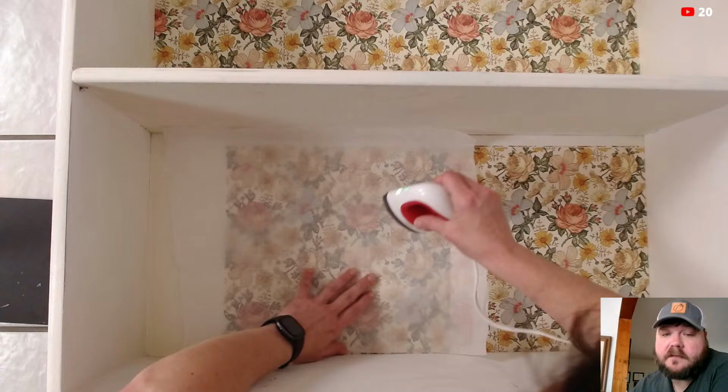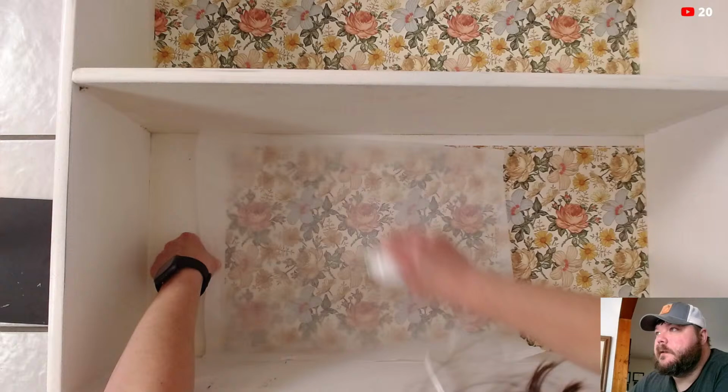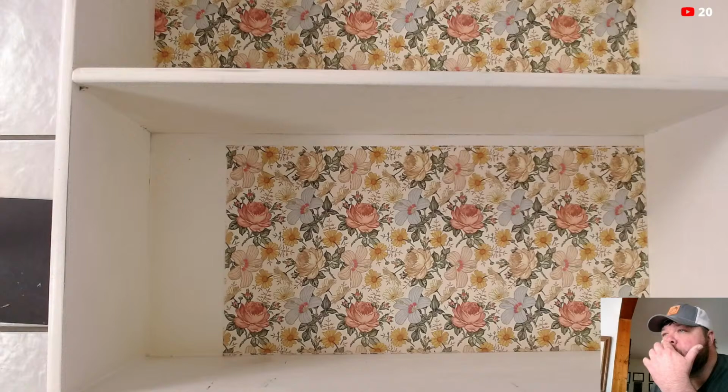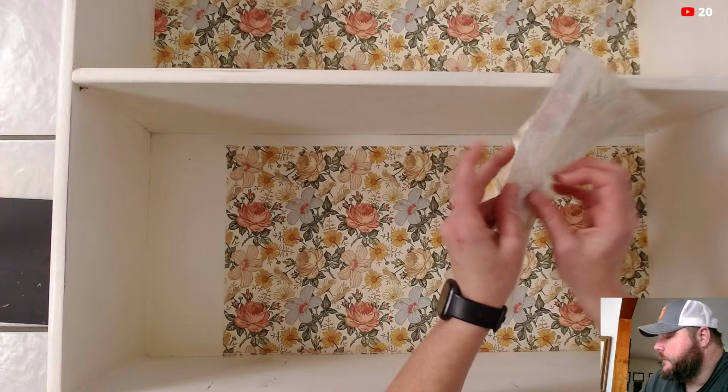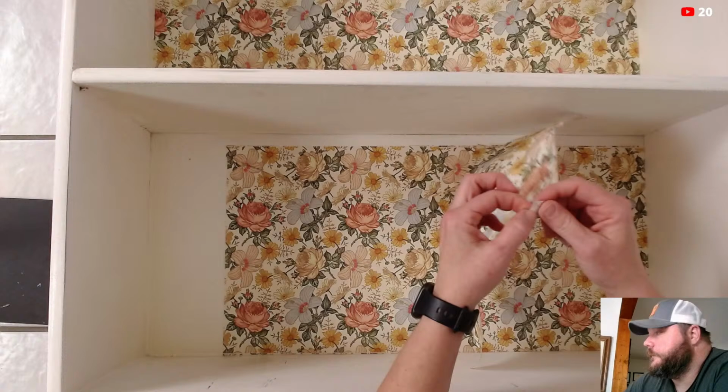Not so much. It's taken me forever to complete it. I just couldn't get the mud to where I butted it up against the previous drywall that's not wanting to mud up properly. I should have just torn out all the drywall and replaced it all the way around so I could get it nice and even. But butting it up against non-flat work has been a real pain. So I'm going to trim it with wood to hide any of the ugliness. Come on, napkin. There we go.